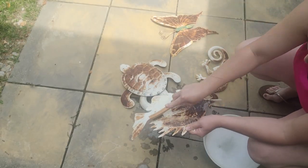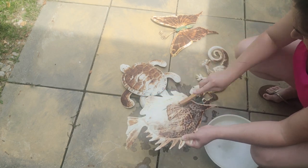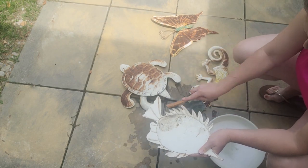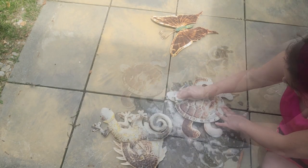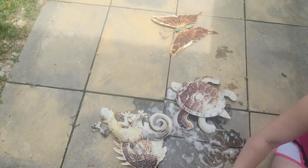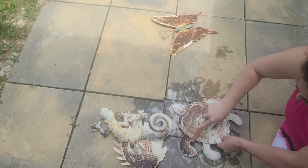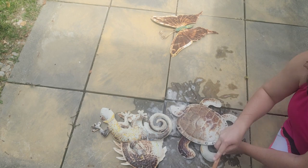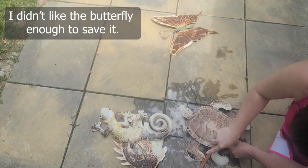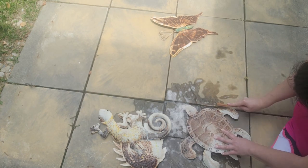I started with giving them a nice good scrubbing — some warm water, some Dawn, and a sponge. I also used a wire brush to chip off any old paint, any loose rust, and give it a really good scrub. The wire brush did a really good job getting in there and scratching it up. This does call for sanding the area as well, so just make sure you're following the instructions on the can for what you're using. Once I was done washing them up really good and getting rid of anything loose, I let them dry fully before moving on.